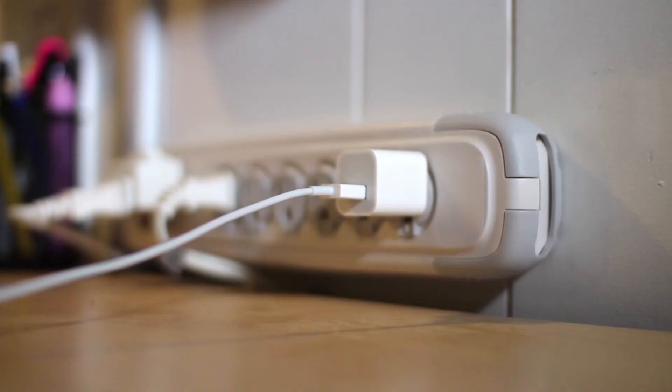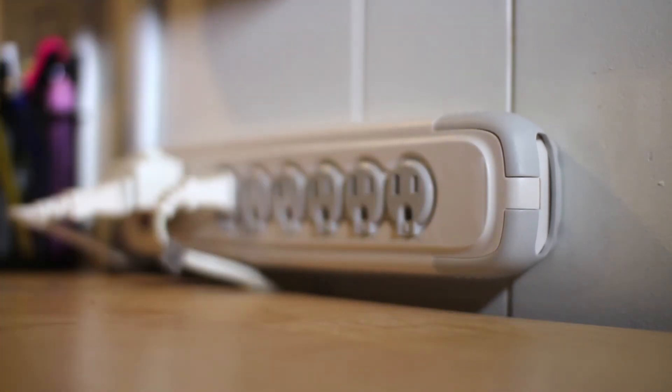To figure out if it's an appliance or not, you need to physically unplug all of the appliances — or at least the faulty one — from the circuit. You may have to unplug everything in your house, but if you know which circuits are losing power you can focus only on those circuits. Usually it's a kettle causing this, so start by unplugging your kettle and seeing if you can reset the breaker and it fixes it. It could be a fan or a number of other appliances. Physically unplug the devices and then you should be able to reset after that.